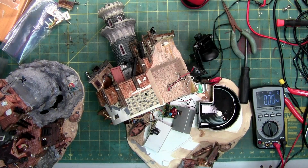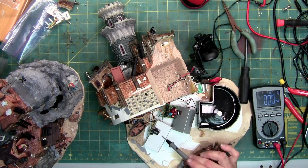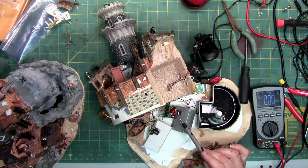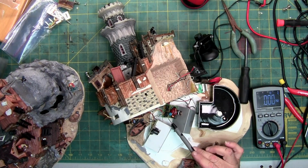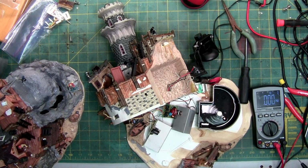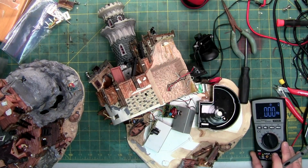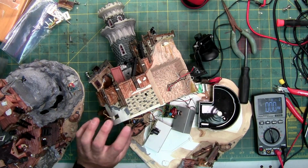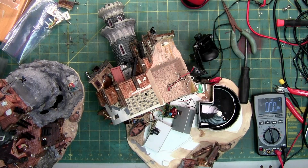So, yay. I have other voltage regulators, but they're different, and I don't know if changing them is going to affect the functionality of this at all at the moment. But testing every component, the diodes are working, the capacitors are working, the induction on the coils is working. This multimeter can test virtually everything. I have good power going through the main circuit board, but I'm not getting the signals from the main circuit board. I'm thinking the blob chip that controls everything is starting to fail.